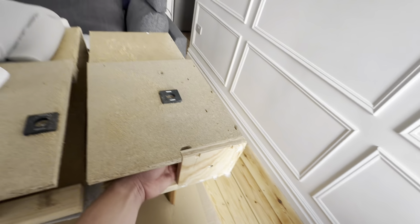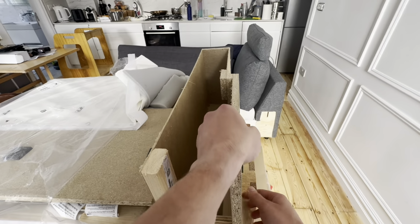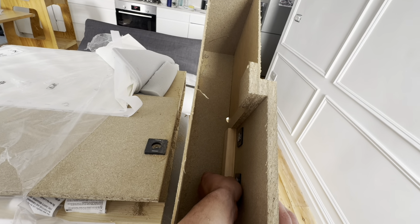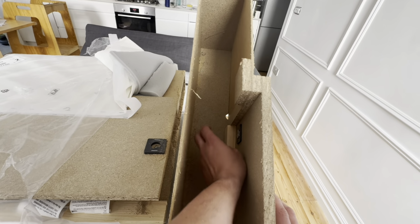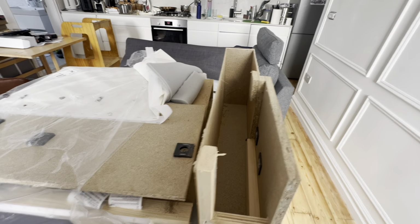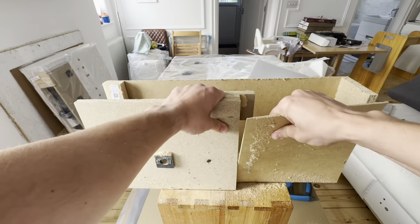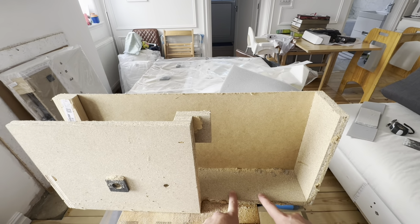Now, like I say, we'll be taking this bit, we'll be taking the front panel bit, and also anything else you see on the inside of this thing. For example, this wooden rail here, we'll take that. This stuff already exists on the other end, so that's fine, we don't have to do anything about that, but this piece we will want, and that piece, and this piece to transfer into this gap. And then we'll staple it back into place, or screw it. For the thin parts, we'll use staples, obviously, but for the thicker parts, you can also use screws. So the key is to preserve as much as we can the pieces that we'll be reusing.